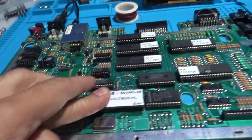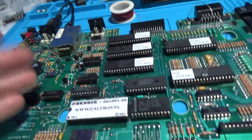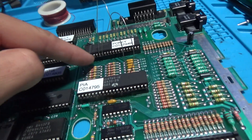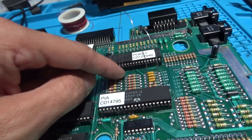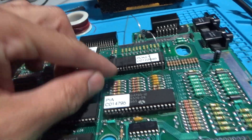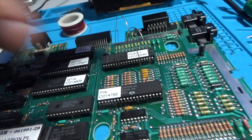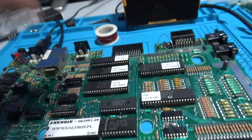Like I said, the Freddy chip was bad. I'm not sure if the other chip was originally bad, but it checked out as bad — it was working for a second and then wasn't. I might have caused that problem by installing the sockets, because they're not making the top trace connections. So I went pin to pin checking for continuity and it came down to those two pins. I just said let me jump them to see what happens, had a feeling it was in this area because I kept switching the Pokey chip and PIA chip.